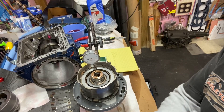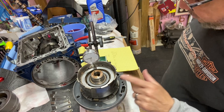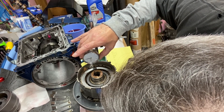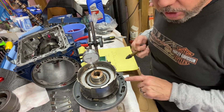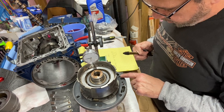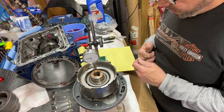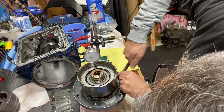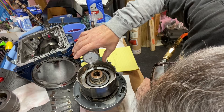I have it set up. Obviously there's the pump, the direct. The clutches are in there and I had them set at 45. I set up the dial indicator — let me make sure that thing's zero. Then I grab my air. You have to correlate the pump to the case: which feed is for the direct and which one is for the forward — I showed you that on a previous video. So this one right here is the direct. It looks like 32, that's 35.